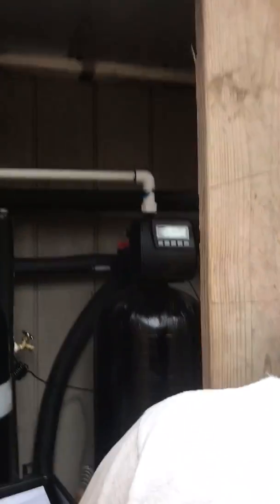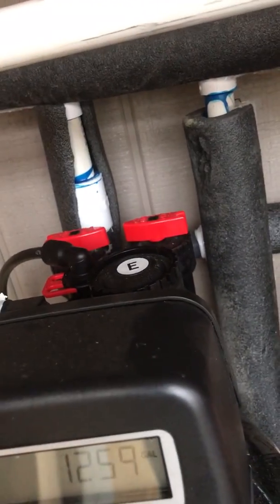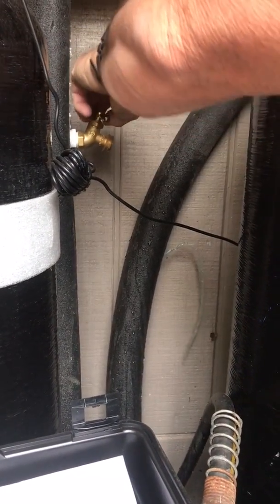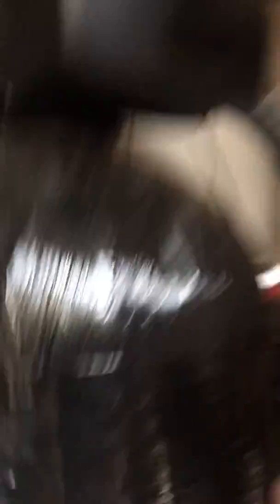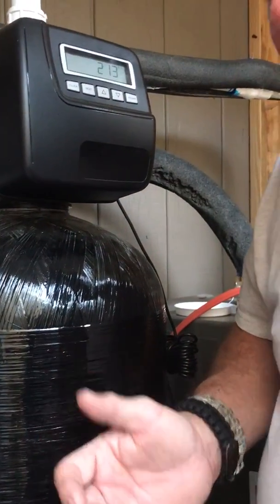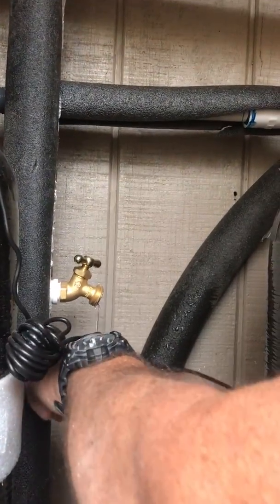Alright, I'm going to put it back in service now, and my water softener is not in service. I'm going to run some water through. Listen to the tank — you may be able to hear water going through. That's because there's an air bubble up here at the top, and you should always hear water coming into the tank. If you don't hear it, then it needs to regenerate and create that air bubble. Now let's test the water — I'm going to rinse out the test vial so we don't have residue from the last test.